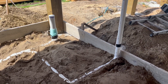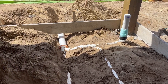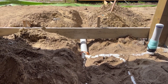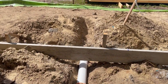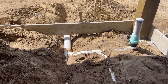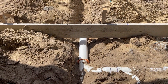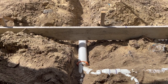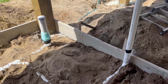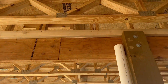And then it's wet vented, like we talked about in the other video, through the lavatory right there. Then the three-inch goes out of the building through a four-inch sleeve where I've got it foamed on both sides. This is our first stack where it goes outside of the building. Also when that stack comes out and ties into this other bathroom, as the three-inch leaves right there, you're going to have a total of nine fixture units on that three-inch line — four from this half bath downstairs and five from the bathroom that's going to be up there going into that stack.